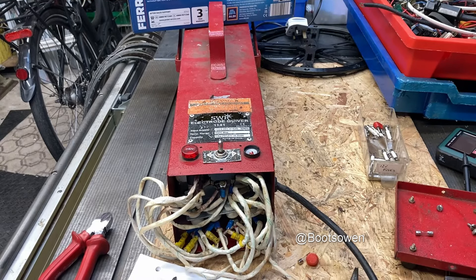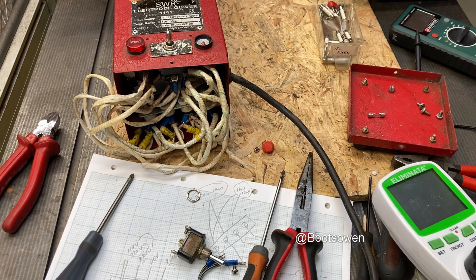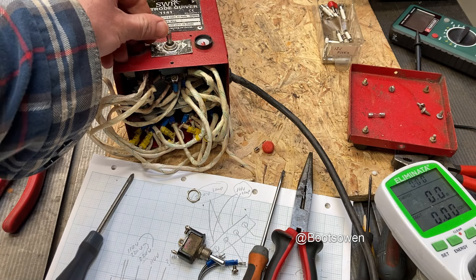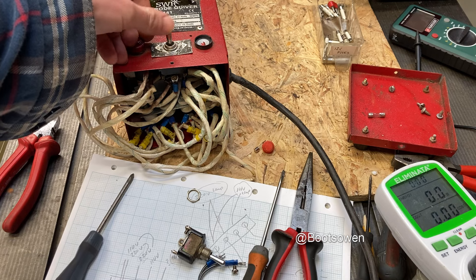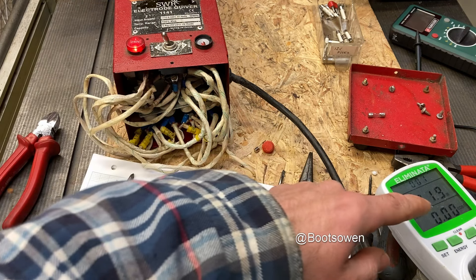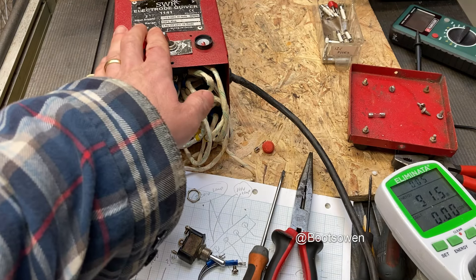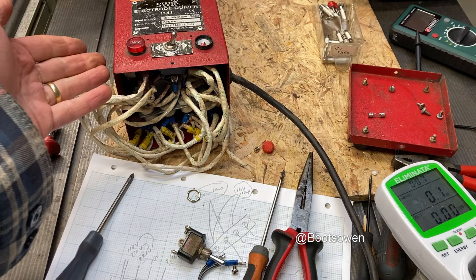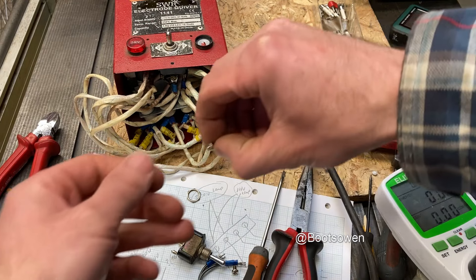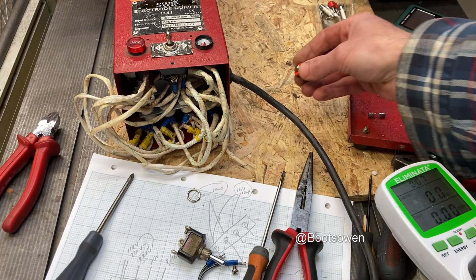The plug's over here - it's in the off position at the moment. Let's switch that on - you can see everything here. We're going live with no fuse in, so on 220/240 it should light up and draw 80-90 watts. And then on this side, nothing should happen. Switch it off, put this in - what's 90 times 3, 270? It was higher than that before.